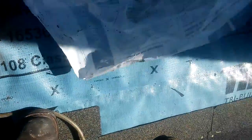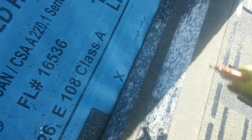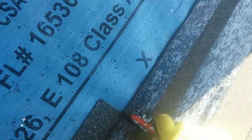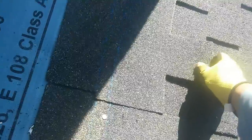You already have the first shingle installed, so you're just following that pattern. Don't forget the 5/15 — look, 515, put it like this and nail. Another trick I want to show you: when you get to the end cuts, you don't measure. Just flip the shingle around, cut on this side, then flip it back again — that gives you the perfect cut. There are little tricks you learn on the trade; you don't need your tape measure for these details.